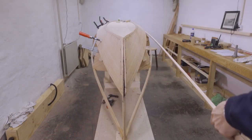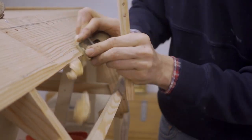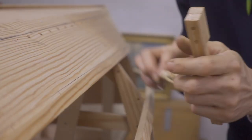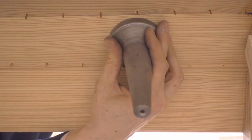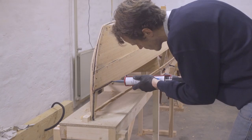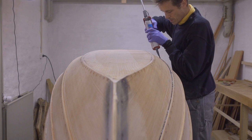The remaining two planks go on in a similar way, although they won't need steam bending. Here I'm beveling the edge of the garboard plank to make it fit the middle plank, using a flexible batten and a notched stick of wood to help me get the correct angle all the way. In combination, the batten and the stick act as a placeholder for the middle plank, so if there's a good tight fit under my stick, there'll also be a good tight fit at the plank joint. The middle and the shear planks are fastened with rivets, clenched nails and screws. The shear plank is also nailed and glued to the thin shear clamp. Only the gain areas of the middle and shear planks are caulked to begin with; the rest of the plank seam is caulked after the planking is complete.